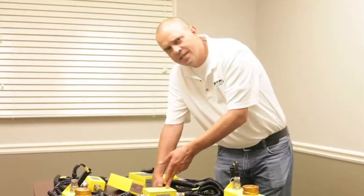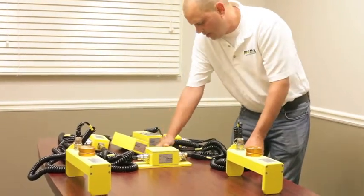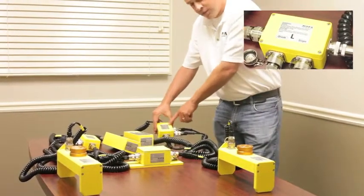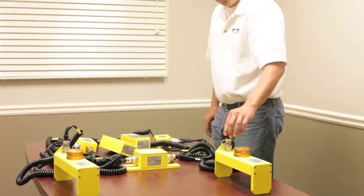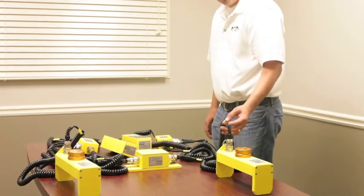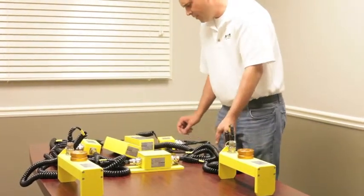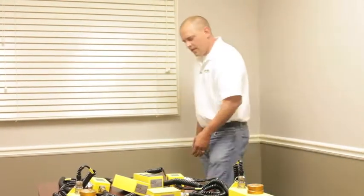We will continue on the left side of your slope box. Here is a 26-20 cable that runs to your left side junction box in the slope portion. Here is your sonic ski on your left side with a 26-20 cable — part number 040202620 — and it will run right into the grade port on your left side slope box. Same setup as the right side.